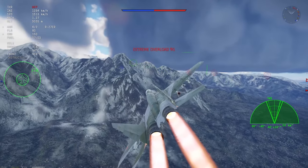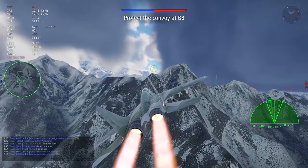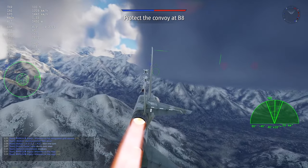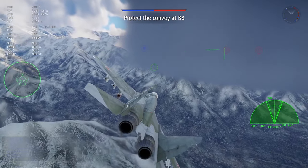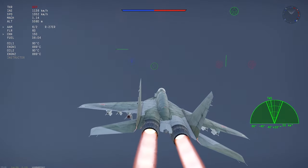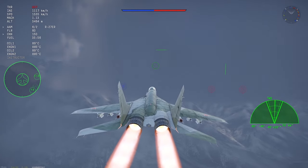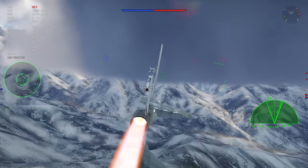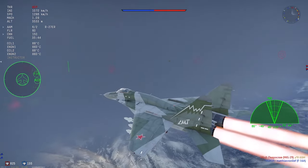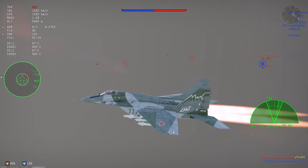So, what are the advantages of using AESA radars compared to PESA radars and mechanical radars? The first most obvious advantage of the AESA radar is the removal of moving parts. By having the beam steered electronically by phase shifters, you remove the need for a moving radar dish to perform scanning. This means that you can scan near instantaneously, dependent on how fast your beams are moving.